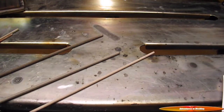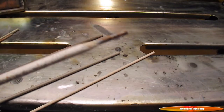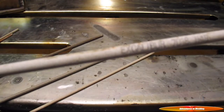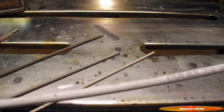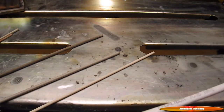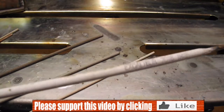That brings us to our last group, which is probably the most popular. If you're just starting out in welding, this is probably where you want to start. We're talking about the low hydrogen group, or what we call low-hi's. This is a 1/8-inch 7018 known as a Jet Weld LH-73. It can be run AC or DC plus, DCEP. For 1/8-inch, run 105 to 140 amps AC, or DCEP 100 to 140. I personally like to run it at about 125 amps. Your mileage may vary.